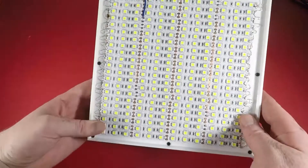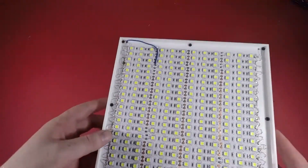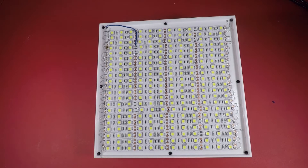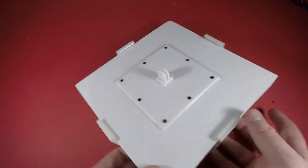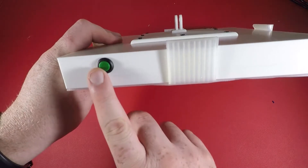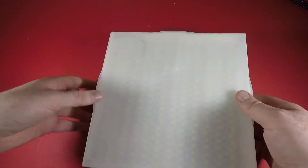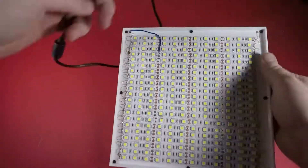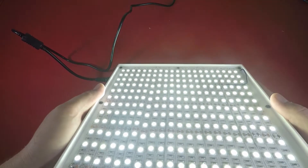Hello everyone, today I have designed a bright LED light. Everything on this except for the electric components are 3D printed. I found that PETG works perfect to resist the heat from the LEDs. I even used clear filament to print a light cover and found that it diffuses the light nicely. The 3D model will be available at Thingiverse - link in the description below. I also made it able to mount on a tripod easily, included an area for an on/off button, and on the bottom a 12 volt input. In this video I will go over the design, the parts and tools, the build, and at the end the results with and without the light cover.